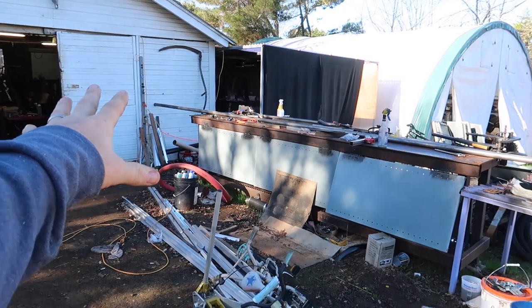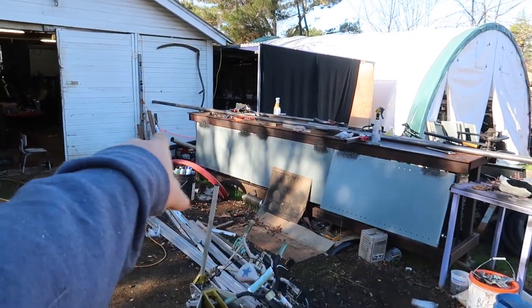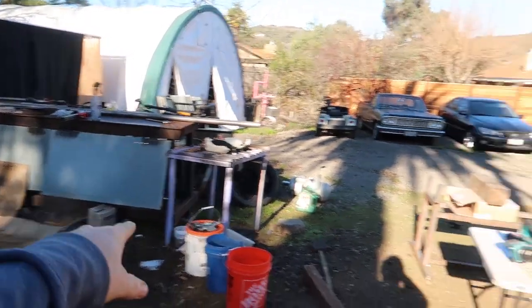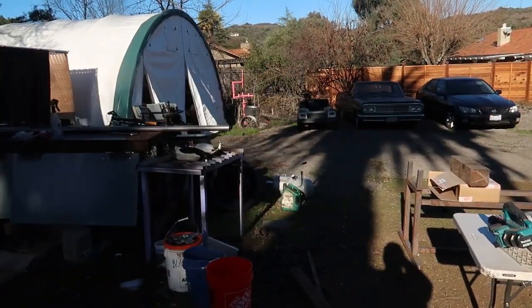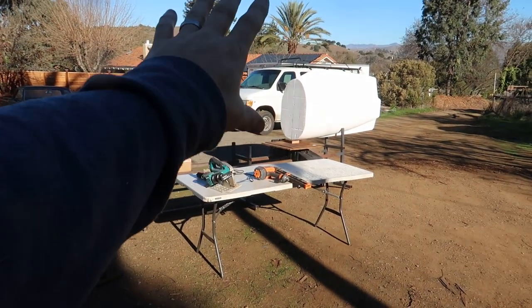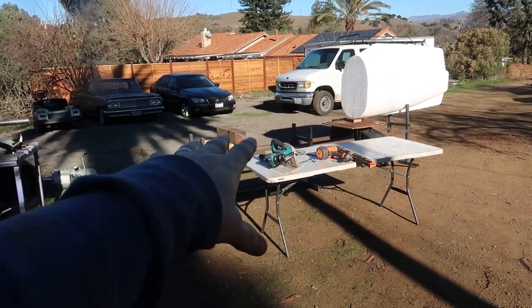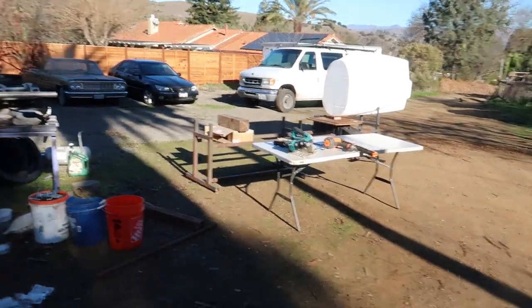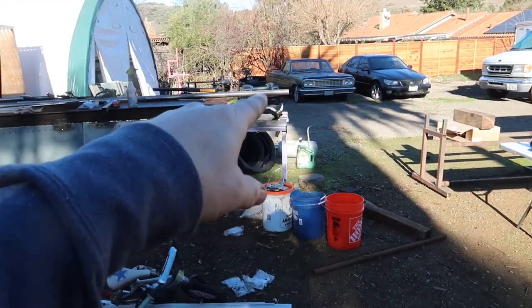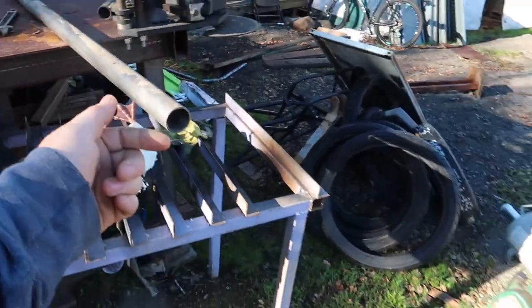So the setup is, this is a 13-foot jig table with a 20-foot steel pipe across it. And then I got my stand out here, and I'm gonna set up the styrofoam, and basically level everything out. I'm gonna hot glue the three sections together with just spot pieces. And after we get those hot glued together, we're gonna make sure everything's lined up, and we're gonna try and start to shove this steel pipe down the front edge.